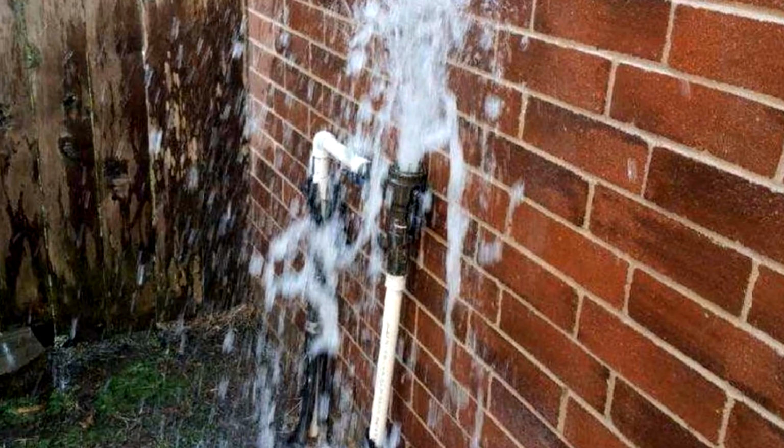PwC has a leak detection program. It's where we pull data from advanced meters. We look at the data to compare it to what you normally use this time of year. Basically, we'll check to see if you have steady consumption for 24 hours. If you do, we do the following 3 steps. We'll send you a postcard if it's a small level leak. For a medium level leak, you'll receive a robocall. And if it's an extreme, higher leak, as far as what we value as high, we'll actually send someone out to check your usage on site.